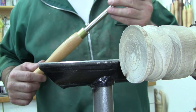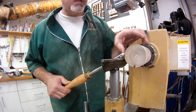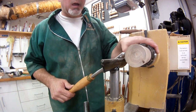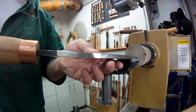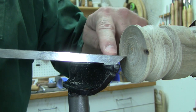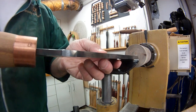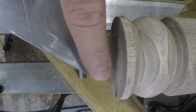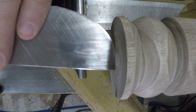The second most important thing about scraping: when cutting, some energy tries to push the tool down as leverage, but some energy comes down the tool, which just pushes you off the cut — never a problem. With scraping, because the tool is always slightly downhill, there's never any energy going down the tool. All the energy absorbed by the burr is leveraged straight down. So be careful how much burr you engage at once. As a general rule, I try not to engage more than three-eighths of an inch at a time — at most half an inch — because too much engagement means a lot of pressure and the wood will push the tool down.